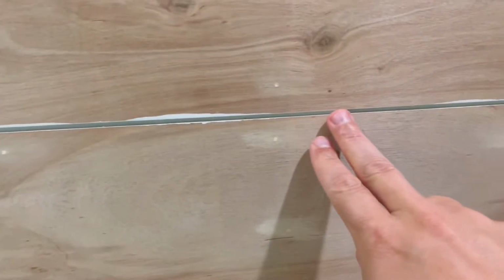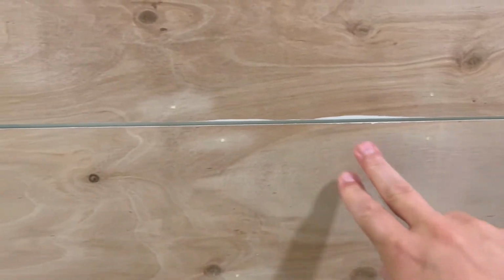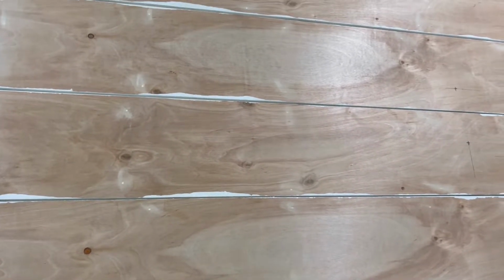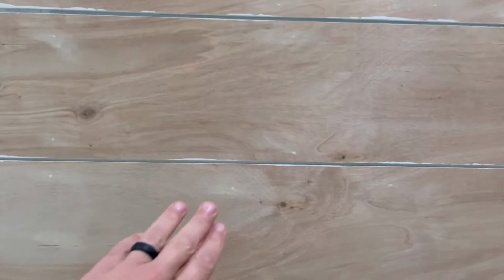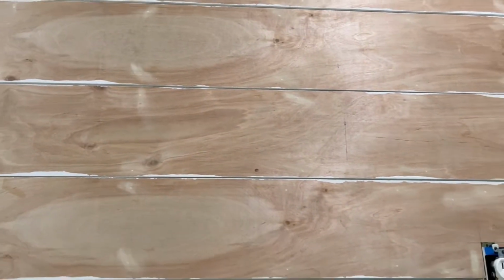So now you can see that there's no pressing anymore in the corners where there were before. It would slightly press against the wall, or come out a little bit. So, once that glue, and it doesn't have to be perfect, just glue to kind of hold it to the wall pretty good. There are brad nails in each of the studs, so that's going to hold it as well. But that's why I was putting that glue, because it makes it pretty sturdy.